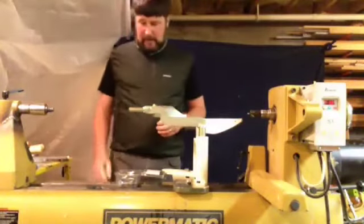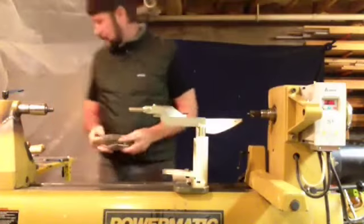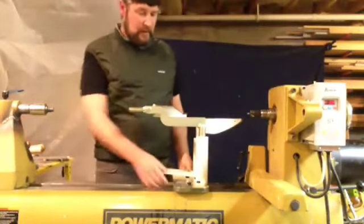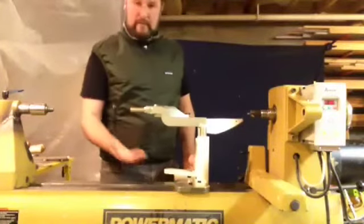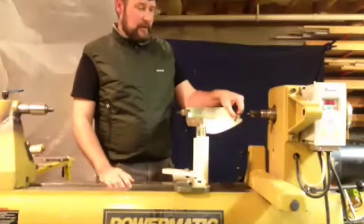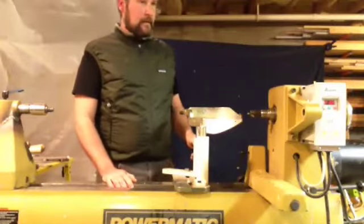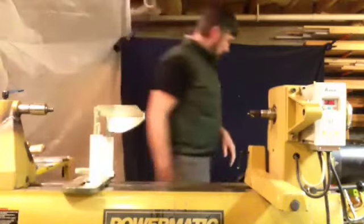And tonight, I think we're only going to use the 9 and the 11. With those dimensions, you do have 1.5 inches of adjust. You can adjust the base in or out to fit. So an 11-inch cutter, you can get up to about 12.5 if you need to. All right, get that out of the way.